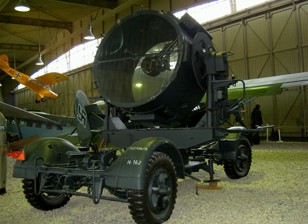The 60-centimetre searchlights were developed in the late 1930s, with a 60-centimetre diameter parabolic glass reflector powered by an 8-kilowatt generator. The lamp output was rated at 135 million candelas, and it had a detection range of about 5 kilometres for targets travelling at an altitude of 1,500 metres. With the beam dispersed, this reduced to about 3.2 kilometres. It required a crew of three and could be transported using a single-axle special trailer 51. One crew member operated the searchlight, another operated the generator, and the third was the section commander.